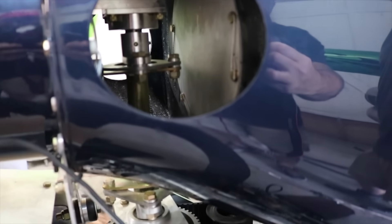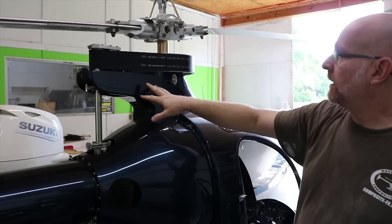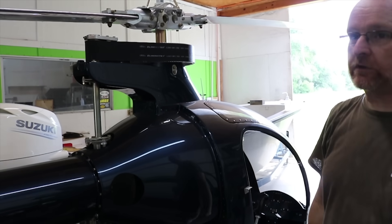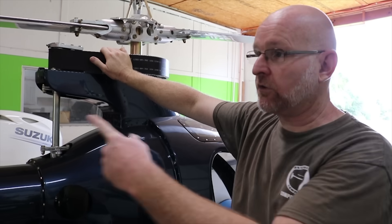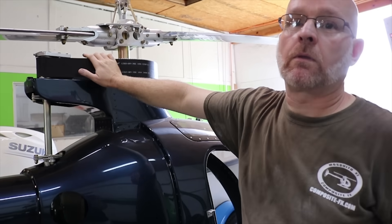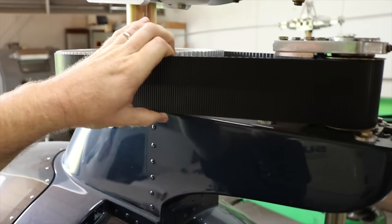The splitter box also sends the remaining power straight up to the final reduction. Earlier we were talking about the mass reduction mount — this is a very rigid component because we're trying to keep this assembly nice and taut so that the belts stay aligned properly. One reason this machine is successful is the ability to use cog belts. The cog belts are very lightweight and we have no transmissions. Service life on a belt is five years or 500 hours. On our upper reduction we actually have two belts — there's a redundancy up top.